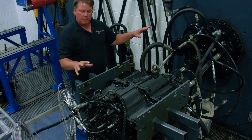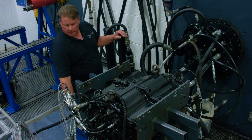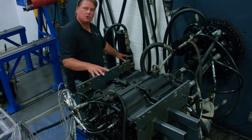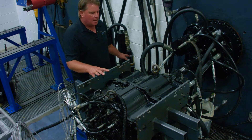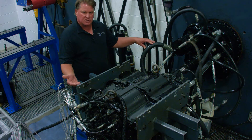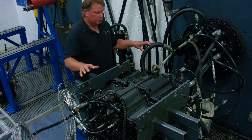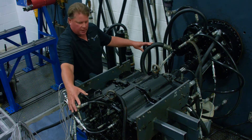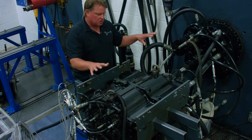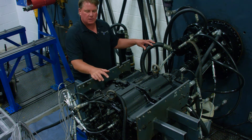Once cooled, the oil will return to lubricate the clutches and bearings inside the transmission. Once the transmission has been hooked up and filled with oil, the service technician will start the engine and will monitor the sump level, doing a quick inspection for any possible oil leaks and making sure we are flowing oil through the system. As the system comes to pressure and begins to run, he will monitor the sump level and adjust it as needed. He will do a secondary pass to make sure none of our check locations, oil seals, or any possible areas could be leaking. If there is a leak, we will shut down and address that.